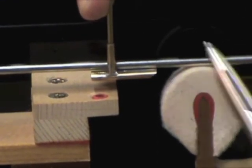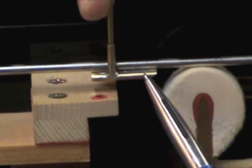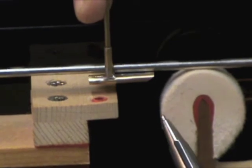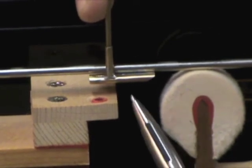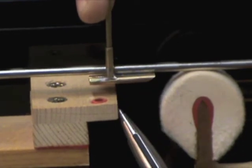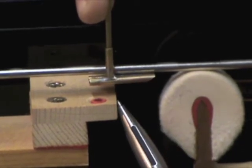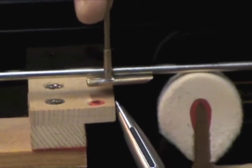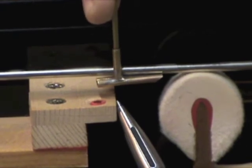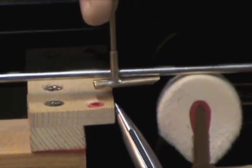Now what is the relationship of the front and back edge of the shaft collar with the front edge of the damper guide rail? And it looks to me like about right there that the front edge is pretty well in line with the front edge of the damper guide rail, meaning that that would be 5/8 of an inch, and that's what you would mark for that particular damper. Circle 5/8 of an inch. If it was 3/4, a little bit farther forward, that would be 3/4.